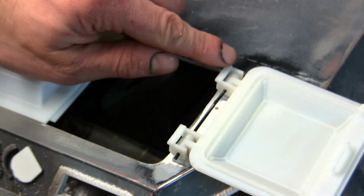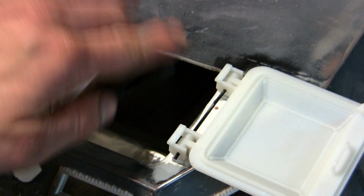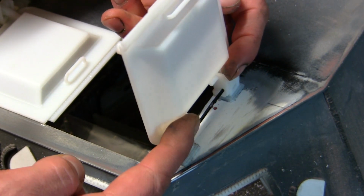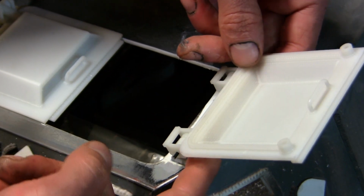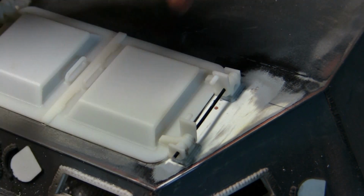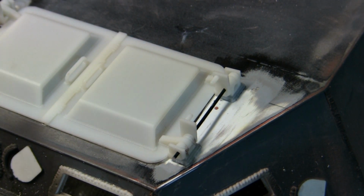With the way this works with this bottom section that we have here, these are going to act as stops and they're going to stop the motion of the counterbalance when it makes contact with this side here of the hinge. So what happens is you'll be lifting up on the hatch and it's going to assist it to the midpoint that we have right here. And at this point, the bottom portions are intersecting with the hinge. They're going to stop moving. As you can see, they can no longer move. But at this point now, you can close the hatch normally, and gravity will do the rest. And the counterbalance will stay in the upright position that we have here. Sounds a bit overly complicated, but it's actually a very simple system.